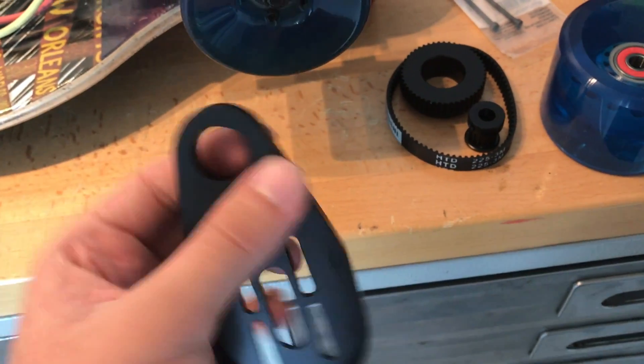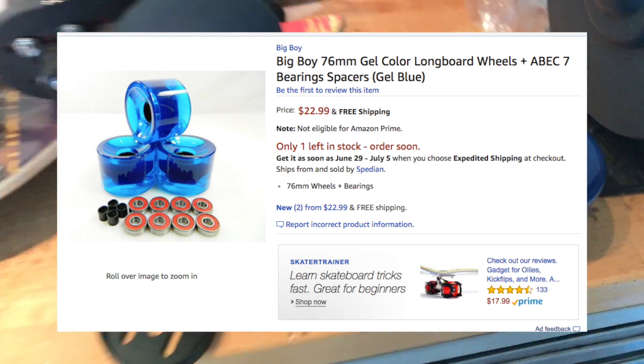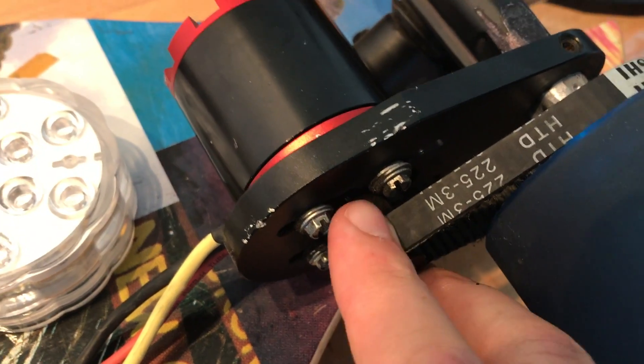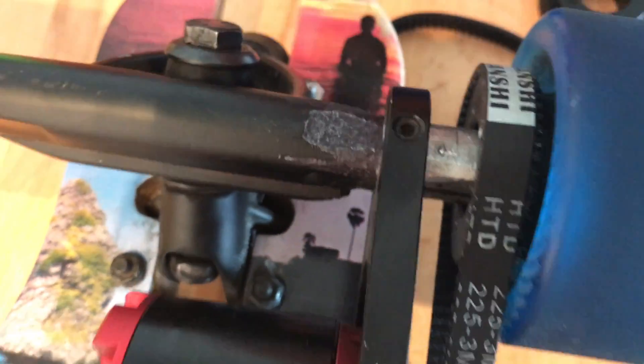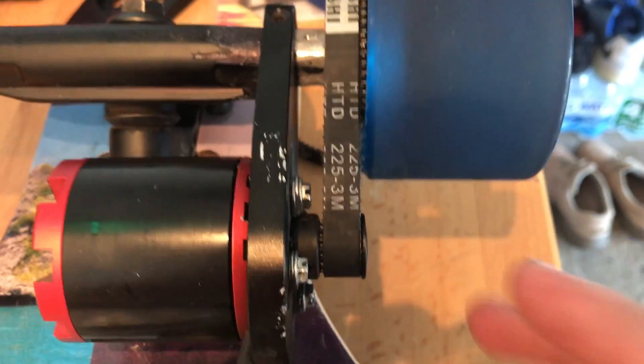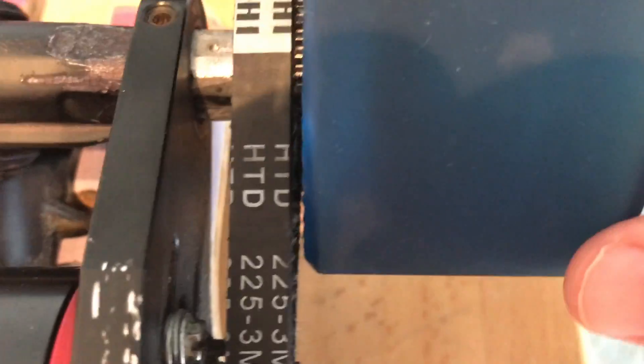Here's an extra — that's what it looks like. Everything is done using set screws. And here's the wheel that I use — large diameter, bought from Amazon. It's worked out great so far. For the construction of the board, I'll start with the motor and motor hub. Everything is tied down using Loctite and set screws — there's a set screw with Loctite on the motor shaft, as well as the motor hub going onto the truck. One of the biggest issues I ran into was the belt grinding up against the wheel. I fixed this by grinding down the truck a little bit and pushing the motor hub further into the truck, which gave enough distance to clear the wheel.